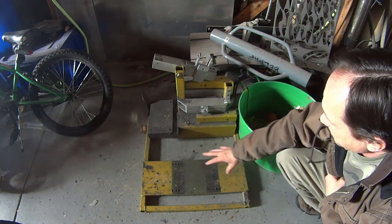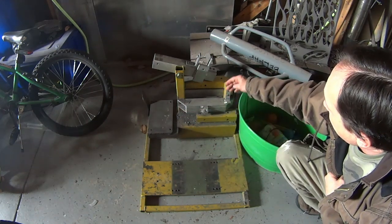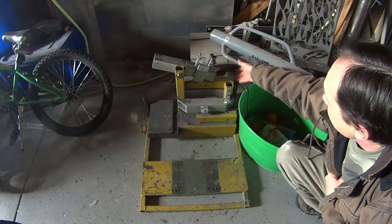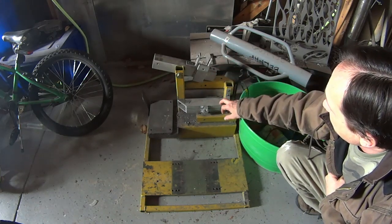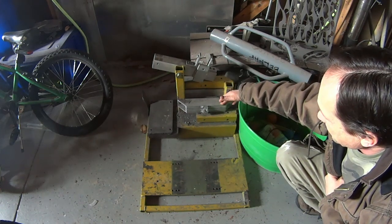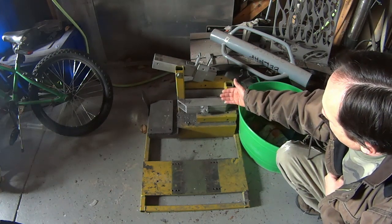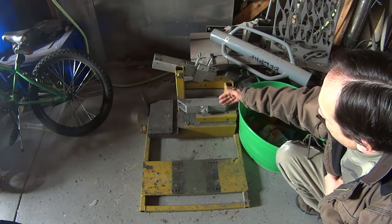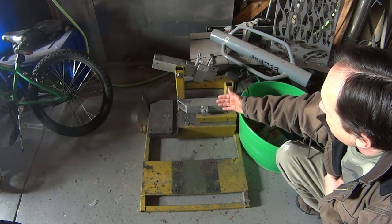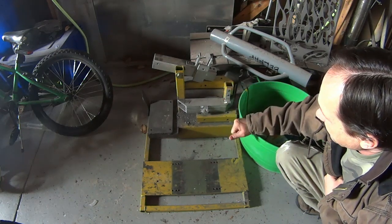It used steel tube, had a 5 horsepower motor, had the drive system there — it was a step pulley. I later added these aluminum parts; this is the tracking deal. I added these aluminum tubes to replace the steel tubes for the tool arm and the tool rest holder. The steel tube was too sloppy, and it was really a pain to get the slop out because I use a bevel guide in my grinding, so it's important to have it accurate.